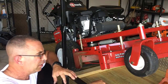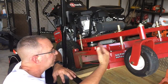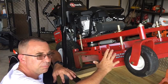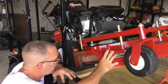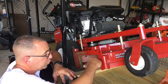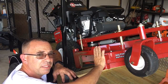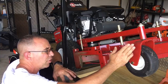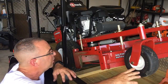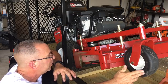The blades that came with this machine are high lift blades — they've got an aggressive wing tip on them. When you put a block on the side chute, manufacturers take a lot of pride in developing these decks to process the clippings and get them out. If clippings stay underneath the deck and you don't have the proper blades, you're going to be slowing your blade speed down and bogging your engine. This deck with these blades is designed to work with the side chute open. When you block it, the grass is still trying to come this way but it can't, so you may find a line of debris alongside your path as you mow.